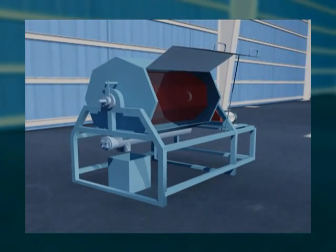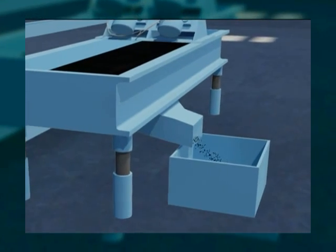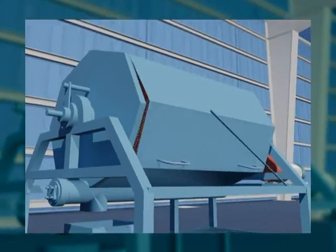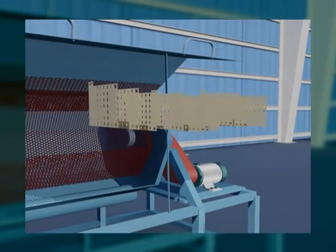The lead plates and lead powder mixture pass through a rotary-cum-vibratory sieve which separates the lead powder from the lead plates. At the end of this process, only the plastic grid will be left behind. This will be sent to the plastic line to be processed along with the plastic container.